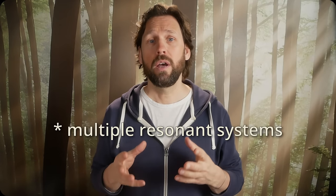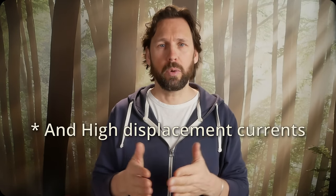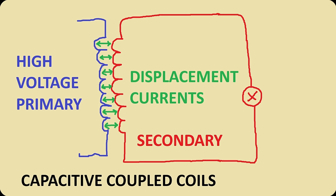For the experiment, I will use resonant systems that are capacitive coupled. These resonant systems need to be tuned to the same resonant frequency. One coil of these will produce high magnetic currents around the coil, while another coil produces very high voltages which are responsible for creating high displacement currents in the capacitive coupling between these two coils. So to be clear, I will have two capacitive coupled coils of which one has a high voltage, while the other has high magnetic currents and there's a strong displacement current in between those coils.